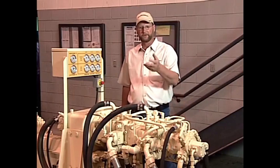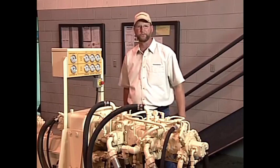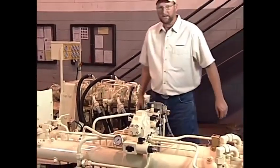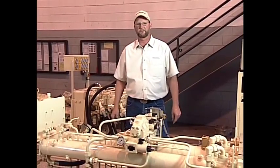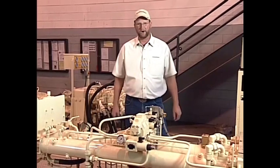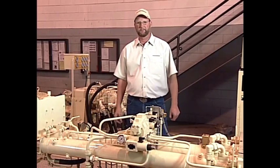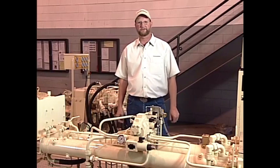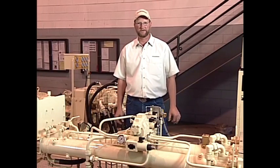Next, we're going to go to the actual free flow hydraulic block and show you how we electrically signal these two main pumps to make your pumping smooth as silk. I'd like to describe how Putzmeister's free flow hydraulic compact block works. This block is the heart of signaling how we stroke our hydraulic pumps to provide smooth flow and pumping performance. We all know that an electrical signal travels faster than a hydraulic signal, and with our proximity switches we can precisely time our stroke change event.